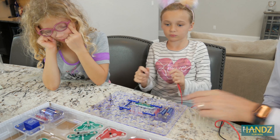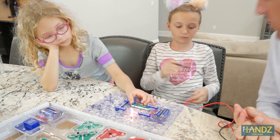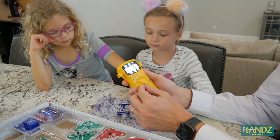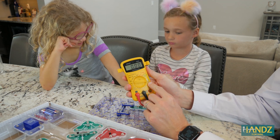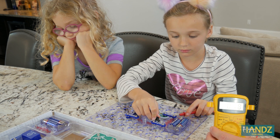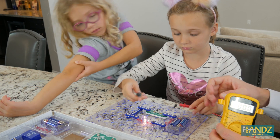We have really charged batteries reading 2.99. Now what we could actually do is measure the current. We're going to take our red lead and move it over to our 10 amp terminal, then switch this over to DC 10 amps. If you do that, you get a huge reading of current, because you're doing something called shorting it out, which we don't want to do — we're going to drain the batteries.